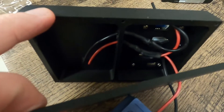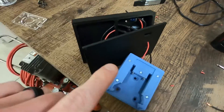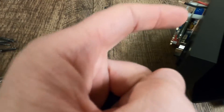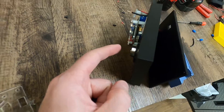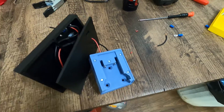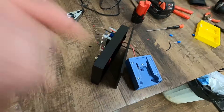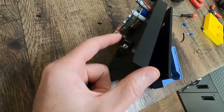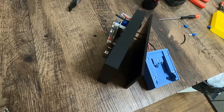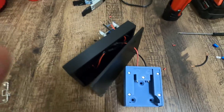I've spliced the wires together, and I've got my M18 and M12 out at the bottom. Now, if I've got an M18 battery on here, I cannot put an M12 on at the same time. Since I'm the only one using this, I'm not too worried about that — I can either have an M12 or an M18. I also need to keep in mind that these leads will be hot depending on which battery is in. So I just need to use one battery at a time, but this gives me the versatility to use either the 12 or the 18 with this unit.